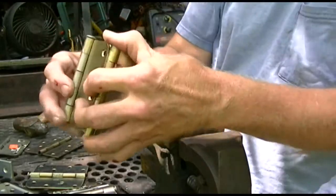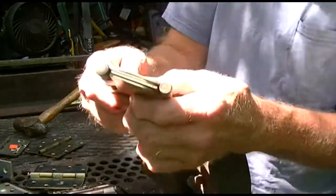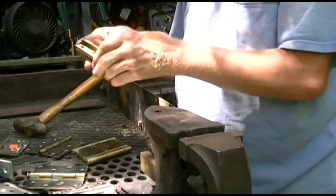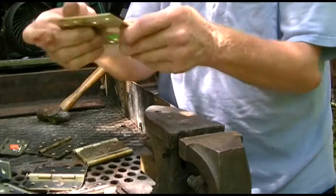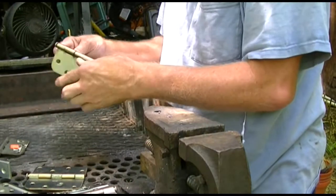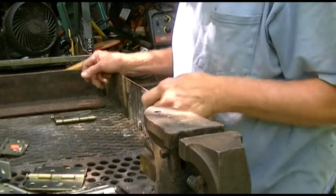I'm going to take these two hinges and lay them together so they fold together like that, and I'm going to weld the hinge itself right here on the corner and on the other corner I'll tack it. Then I'll open them up and secure them together. I need four pairs — two pairs for out here and two pairs for over here. So now we have a flat hinge. We need two pairs for each side: one here, one here, a pair out here and a pair out here.